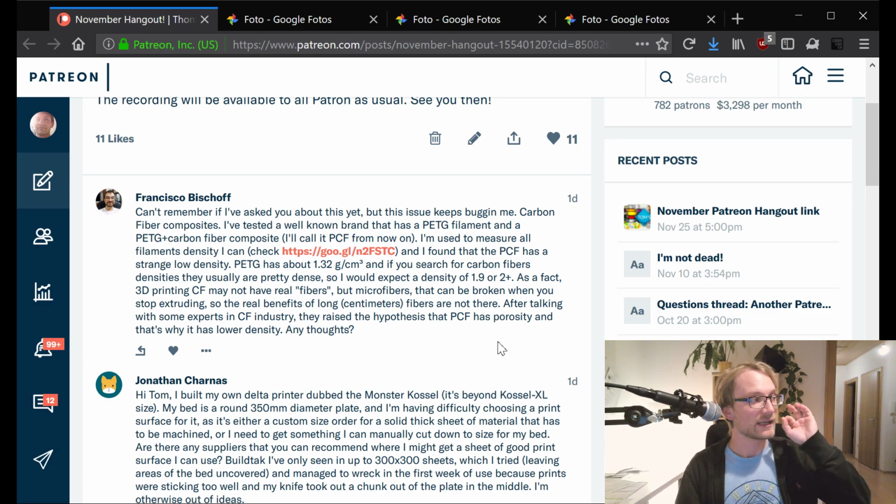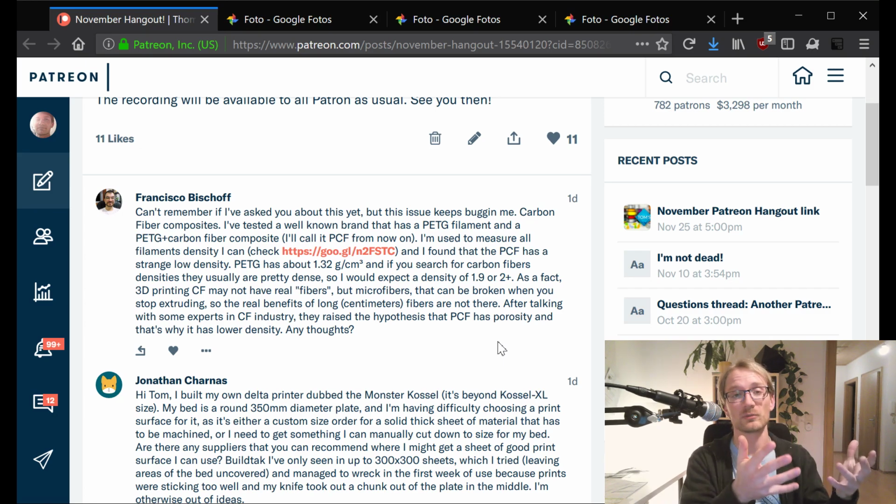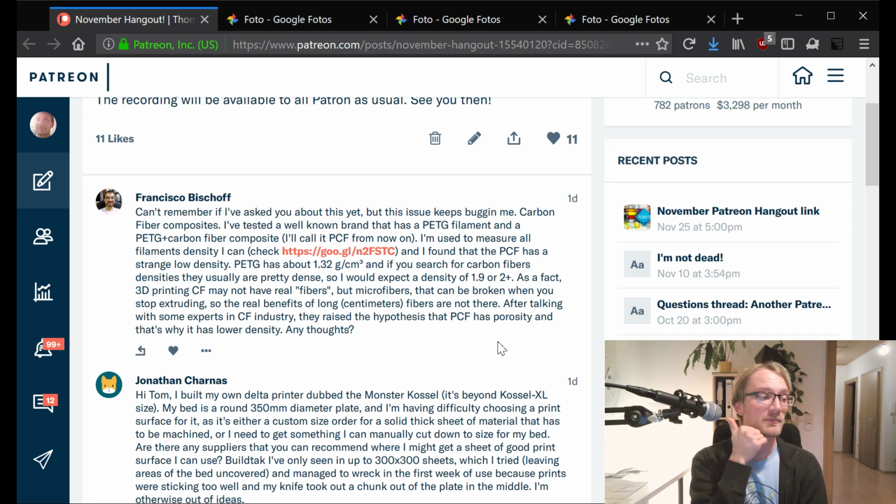And he thought so. Yeah, this has been brought up before. I don't know if it was on Twitter or somewhere else, but what he's writing here does make sense. If you have a carbon fiber made with resin impregnation, like your typical carbon fiber part that has the glossy, shiny surface, that resin is first of all injected at a very high pressure, and it is also a relatively low density, especially compared to molten or heated polycarbonate, PETG, plastics, thermoplastics.